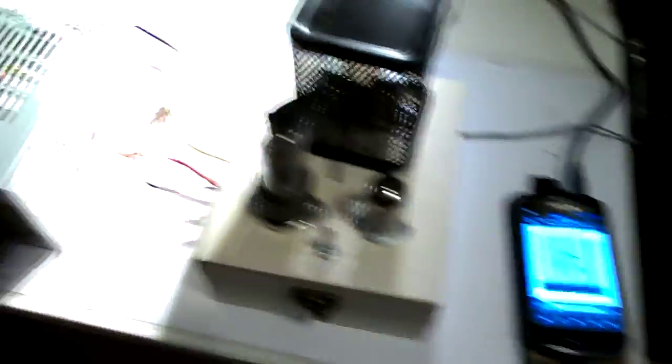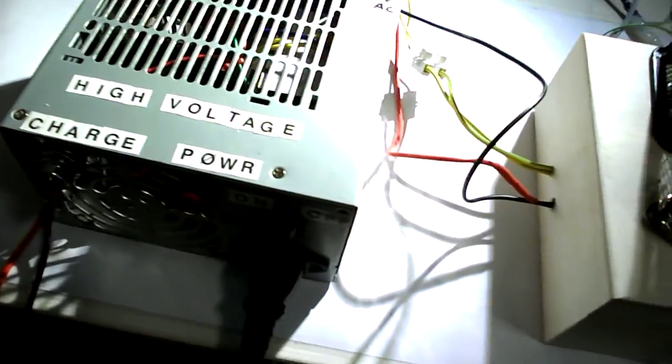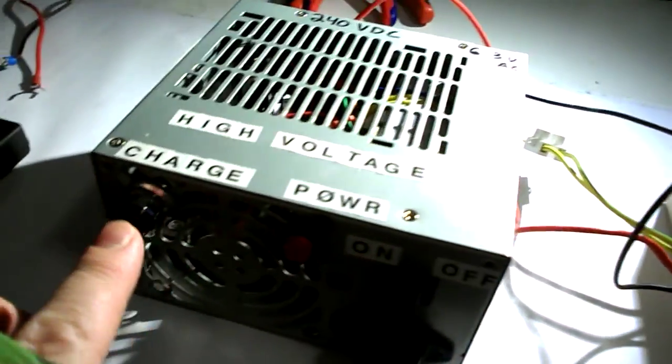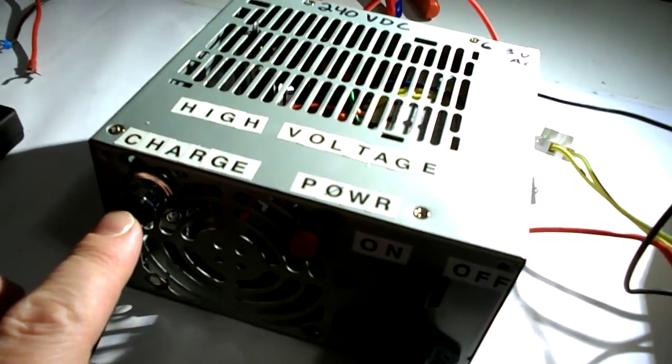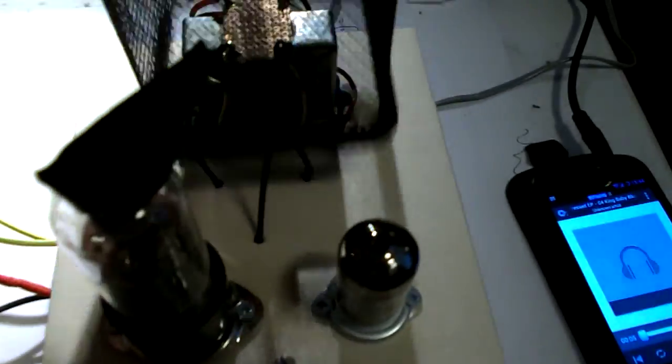This is the one that failed. It was a failure, but I made some adjustments and now it's working again. Over here we have my old mainstay power supply. When this thing turns on, that's the indicator that the transformer is turned on, and that's the indicator that power is coming through the capacitors and that it's charged. It's coming out through the back here — the heating voltage in yellow and yellow-green, and the red and black is the high voltage DC.